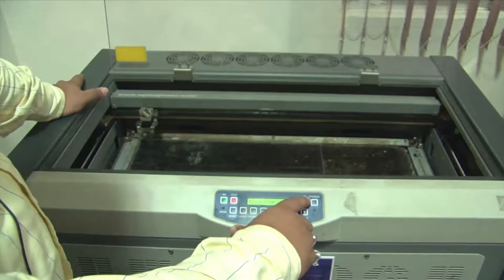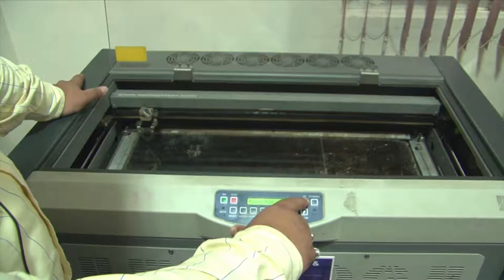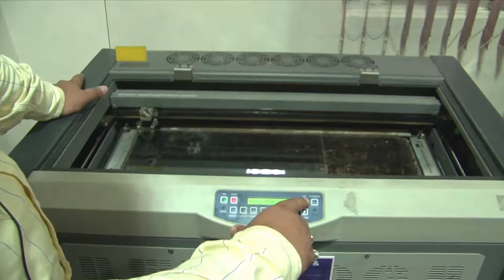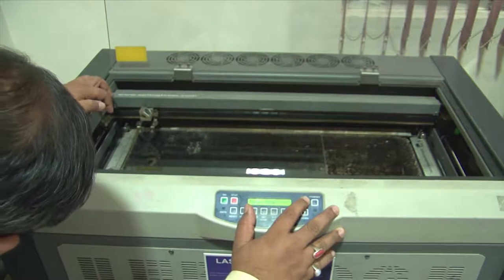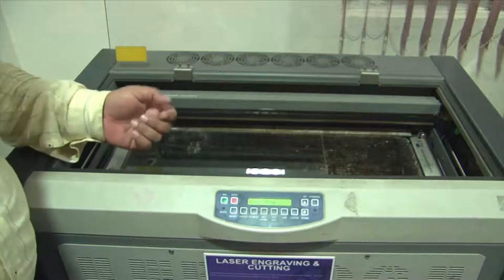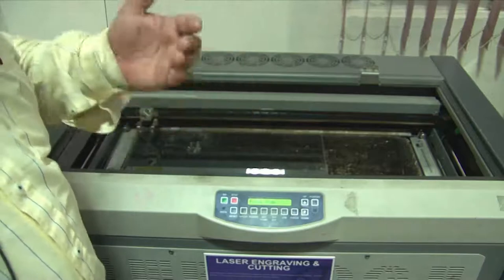So I can move the lasing bed up by the Z motion control. There is a motor and a slide in this direction, and you can see this bed coming up clearly till the surface of the workpiece just about touches the lower portion of the jig. This is actually still not touching, so we can go a little further ahead, and this is right about the focal spot of the laser that it has achieved. You may recall that if the surfaces have various thicknesses, you may use a thicker or a thinner substrate. Accordingly, the Z motion would be different, and therefore this calibration needs to be incorporated on the system itself.